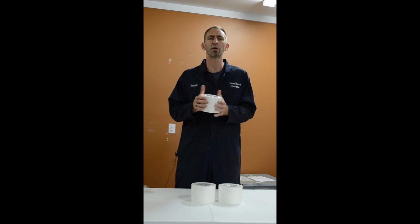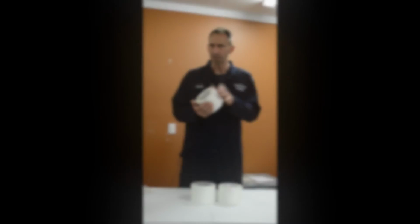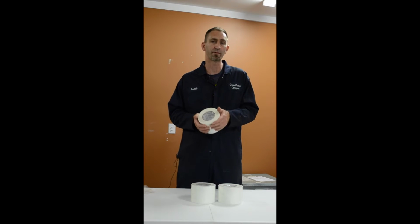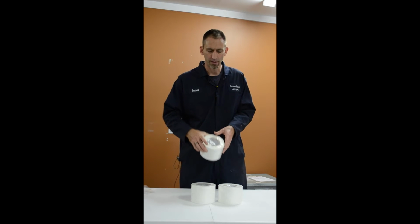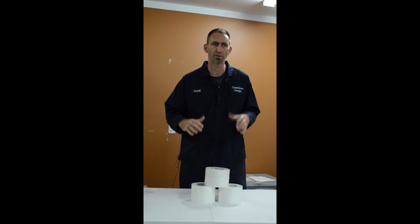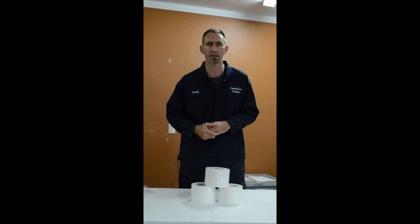And here's the difference between what we offer and what any other white tape is. Like I said, 4 inches wide, 187 feet long. It has a pressure sensitive waterproof adhesive. So waterproof doesn't mean water pressure proof. It's not a tape that will hold seams together if your crawl space floods from underneath, so it's not a solution to not putting in a sump pump.